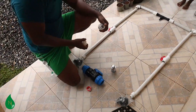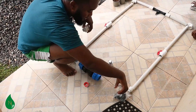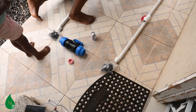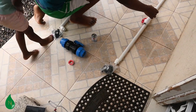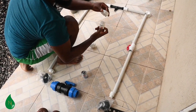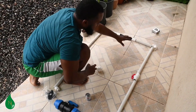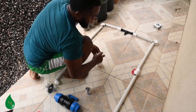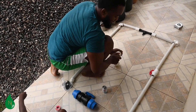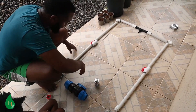One thing — if you wanted to set up the fertigation system in more than one location, you could put the lock-offs lower and the couplings right here. What this allows is that you can just disconnect the top piece from the bottom piece and then transfer the top piece — the most important part of the setup — to another setup and put the fertilization system there. You'd still need a lock-off at each location.